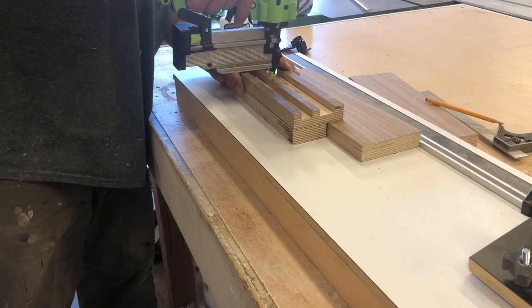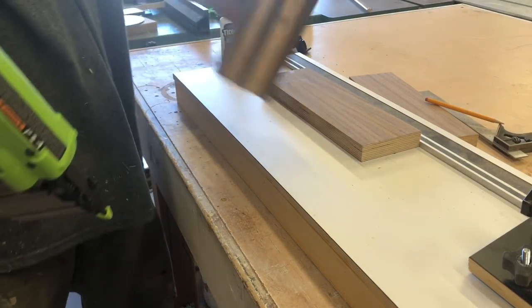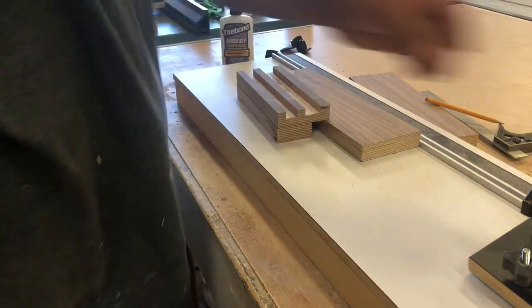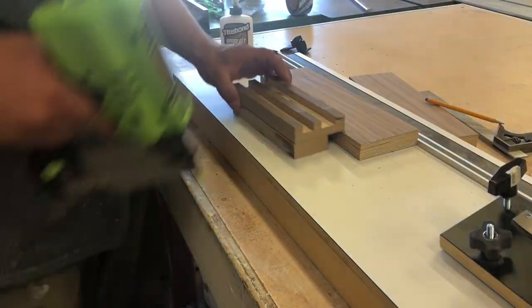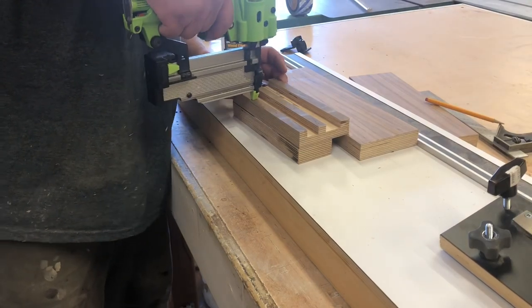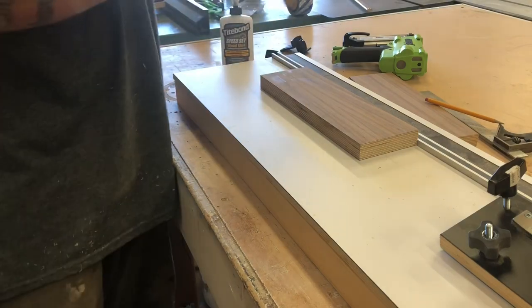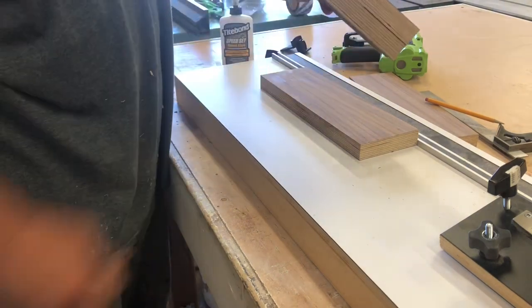You've got to be really smart about where you put your nails — remember, you're going to be screwing and doing all kinds of other things. Obviously I have a template here which helps me out significantly, but just don't go all ham with your nails without thinking about it. Now I can go and route this flush with this one so they're dead smooth with each other.